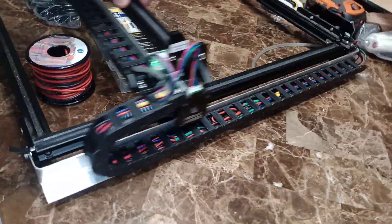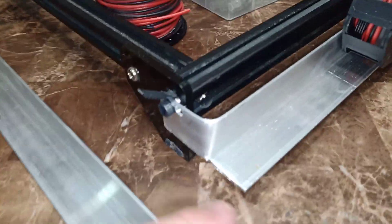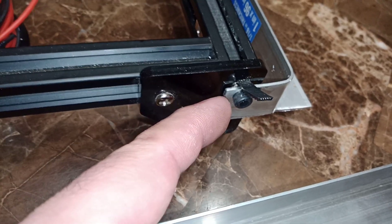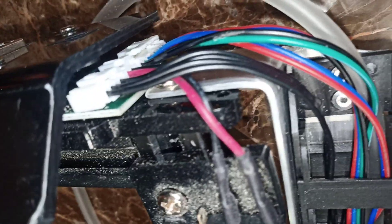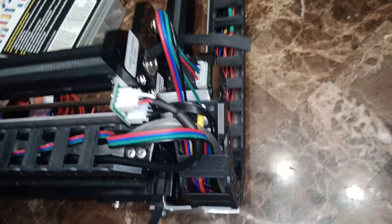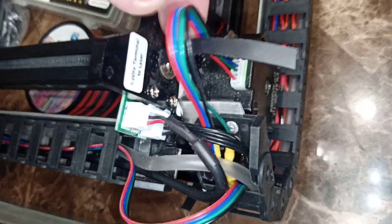I just finished this, that's why there's stuff all over. On this end I did the same trick — I opened this bolt and used a longer bolt. The bolt size is 5mm, thread pitch 0.8. I mounted it over here. The wire comes in — I have air assist — all the wires go in here and travel. I used 18-gauge wire, which is a bit overkill, but there's a lot of stuff in here.